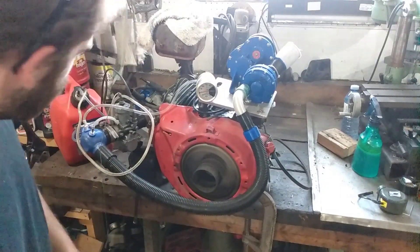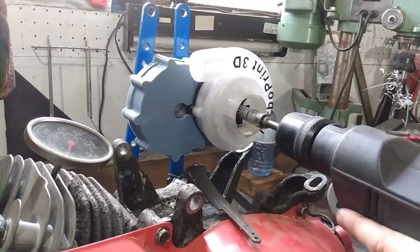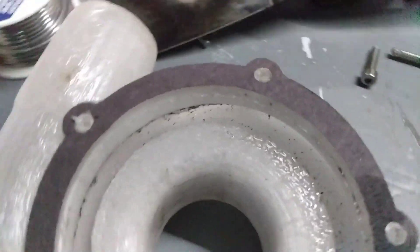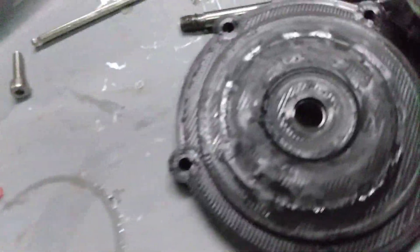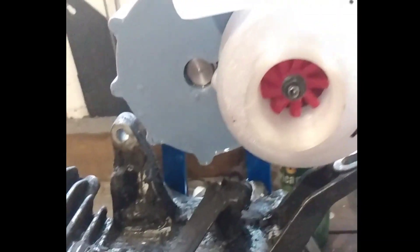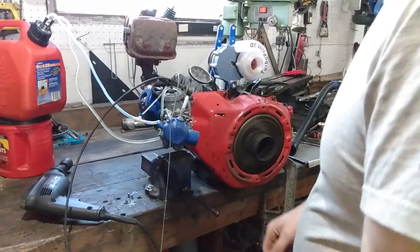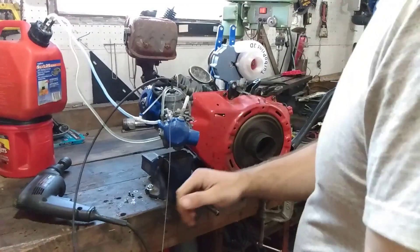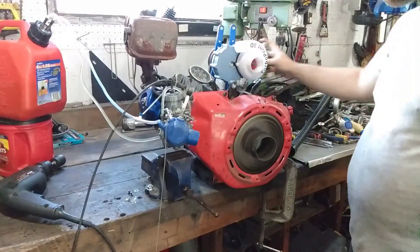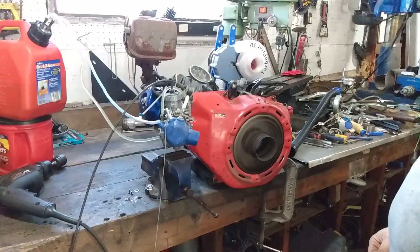I didn't really like that design anyway, so I'm moving on with a better design overall. With the gearbox and supercharger assembled, I mounted it to the engine and tried to break it in with a drill as it seemed tight. After adjusting tolerances, I printed another turbine and cleaned up the original backing plate on the lathe. After spinning it with a drill for about a half hour with no binding issues, I decided to try and fire it up. It seemed alright, so I was going to let it run for about 15–20 minutes to let everything work in, then shut it off and let it cool.